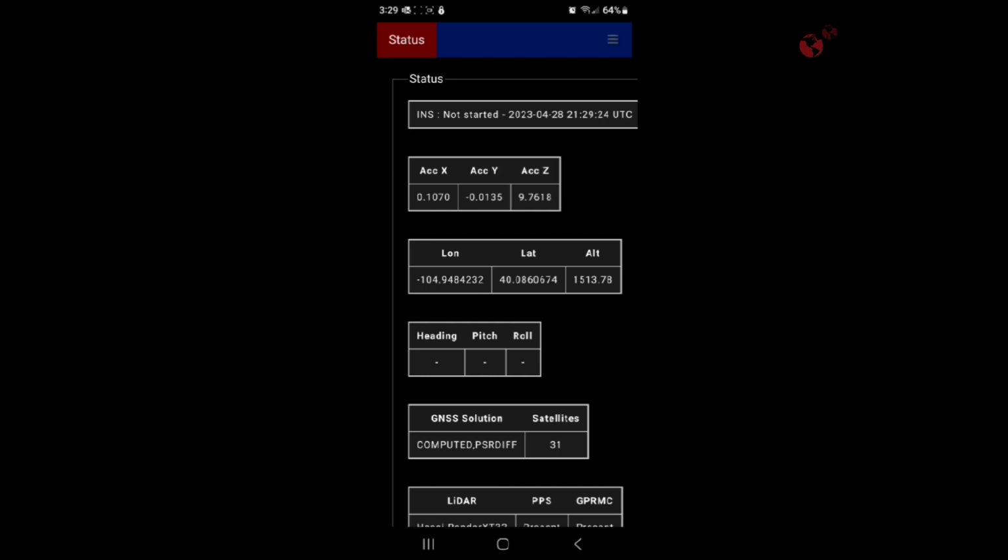We have not turned off our base yet. Make sure you remember that. You always run the base starting it very first. Before you even set your drone up, you want to set up your base. The last thing you do, the very last thing you do, even after you put the drone away, everything, then turn off your base. Don't turn your base off until you're completely finished.